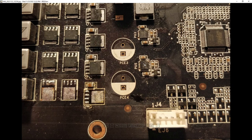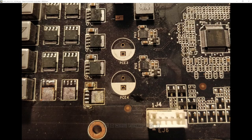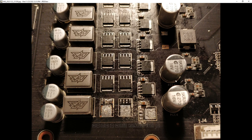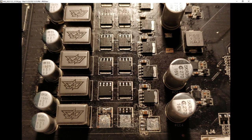In order to remove the driver, we obviously have to heat up the area with hot air. The concern, and the whole reason I removed the two bulk capacitors for input filtering, is because these are aluminum polymer capacitors. While they don't have any liquid inside them, if you get them hot enough they have a tendency to just pop right off of the board — very unpleasant. I actually almost got a capacitor to the face that way.